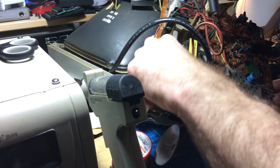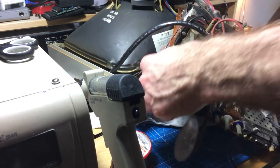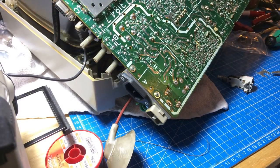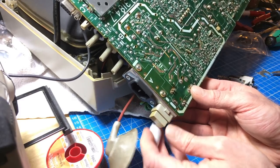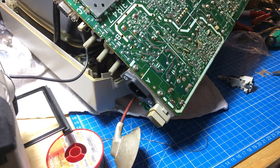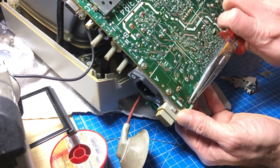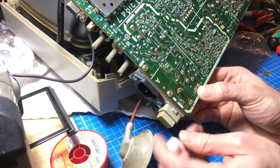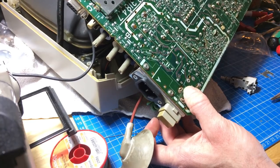Let's insert that into this. All contacts are through — nice. I absolutely want to solder it in place, but first let me check if it fits this part — yes it does. I'll solder it in place. I'll use tweezers to bend the tabs sideways to hold the switch in place, and then put solder on there of course.